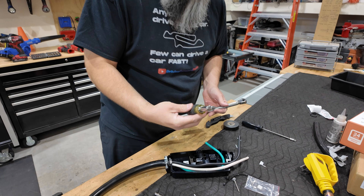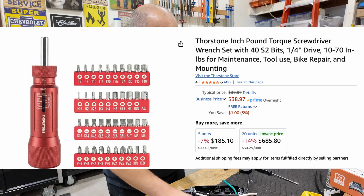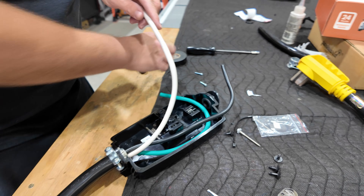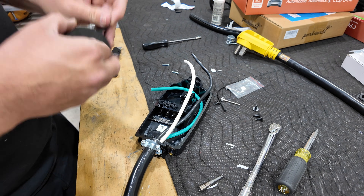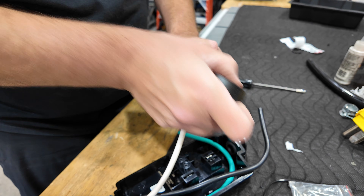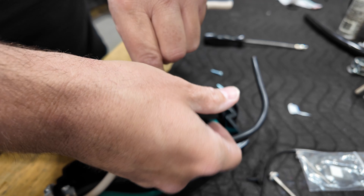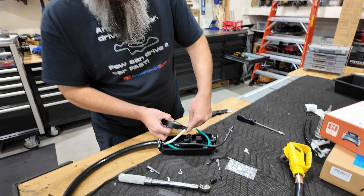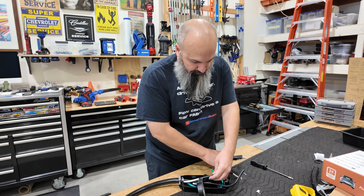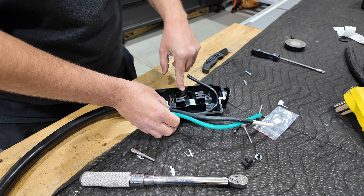There are also torque wrenches meant for electrical service work — screwdriver-style torque wrenches that go down pretty low. What I'm also going to do is re-identify my neutral with some identifying tape — this backwards tape sticks as I'm wrapping — so that anybody in the future who opens this up knows this is a hot leg, not a neutral. Any electrician opening this up would know the system has two hot legs, but a handy homeowner would want to know for sure this was a hot leg.